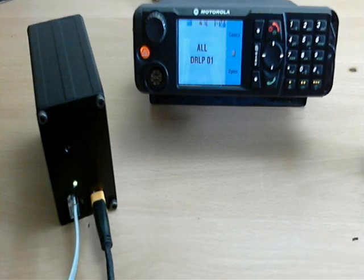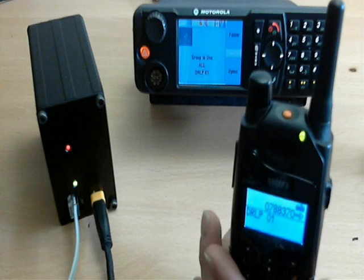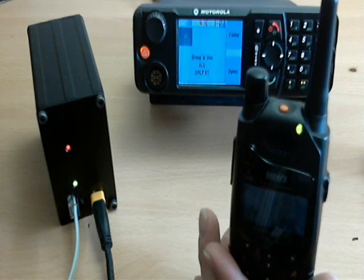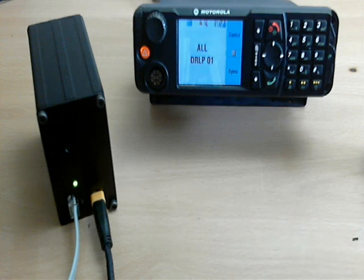Test, test, test — this is an audio test using Free Radio Network parrot. What I'm going to do is press the talk switch and then almost immediately start counting up to 10 quite quickly. The idea is just to see what is played back — to demonstrate whether this system misses the first couple of words or the first syllable that somebody says. Let's see what happens using COM port keying.